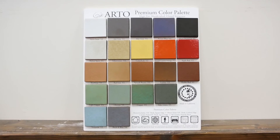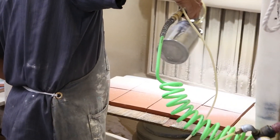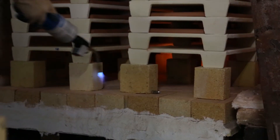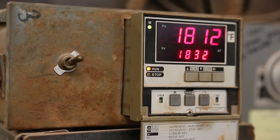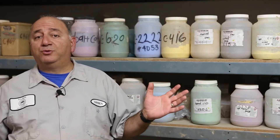The premium glazes are built on top of the classic, so the foundation of the premium glazes sits on top of a very durable, strong body. The premium glazes are fired at the same temperature as the clay. The premium series can be used on floors and walls, in wet areas, exterior in freezing conditions, and in submerged applications like a pool line.